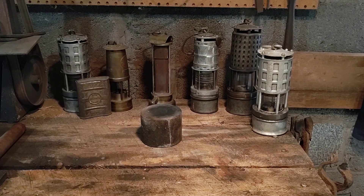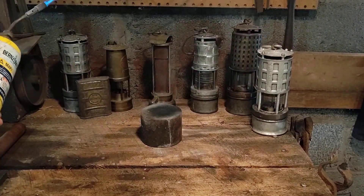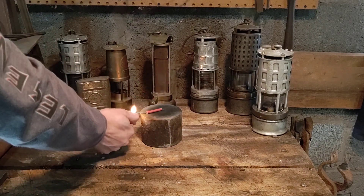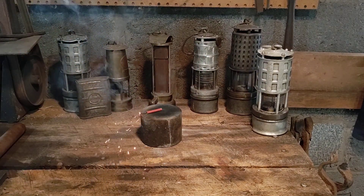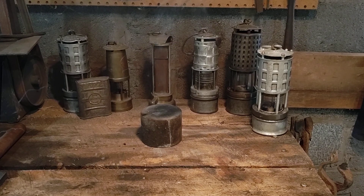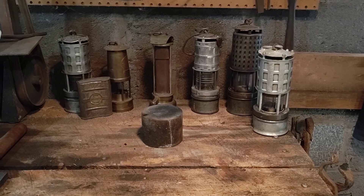To demonstrate the deflagration of black powder — on the block in front of us we have a small amount of black powder. When we ignite it, you can see it does just burn rapidly. Then when we talk about our need for confinement: if you imagine taking that same black powder and packing it tightly, this is the result — this is why you tamp your charge. It does a lot more work for us. So now we're going to head outside.